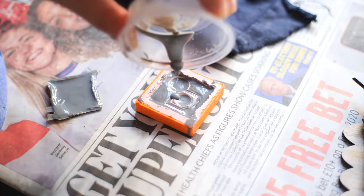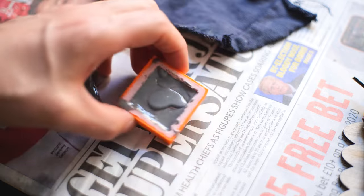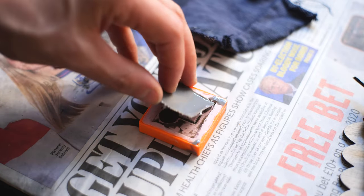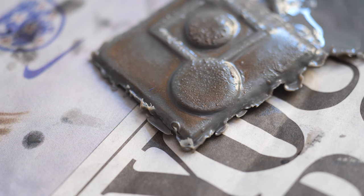Next I tried doing it layer by layer, exactly like how a 3D printer does it, just to build up the print. The metal powder did bind with the resin, but it was quite brittle and nowhere near smooth enough of a surface to be used for foil printing, as you can see in the close-up shots.